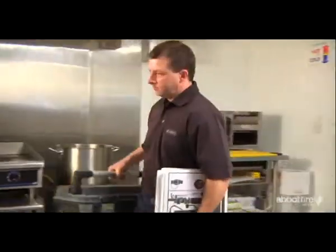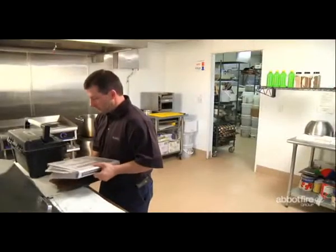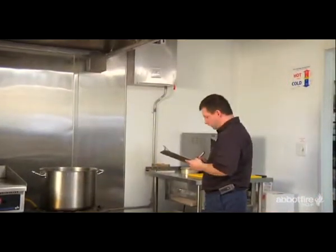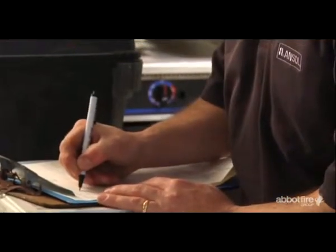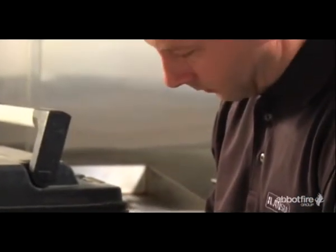The following inspection will be performed by Abbott Fire Group's technician on a semi-annual basis. All detectors will be examined, as well as expellant gas in agent containers, piping, releasing devices, nozzles, hose assemblies, signals, and all non-pressurized wet chemical containers.